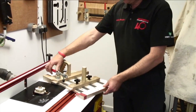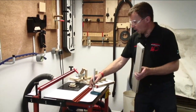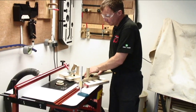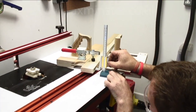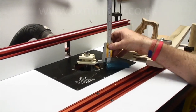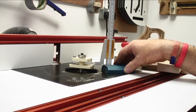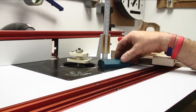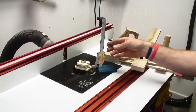We can use the mortise piece we just cut as our cutter height guide, and we'll also use a height gauge. When we cut the tenons, the wood goes face down. So with the rail, we've got our face mark — we're going to put it face down, load it, and lock it off. From there we use our height gauge, bring it down, and lock that. Then we move the cutter height — on the Bosch router we've got quick movement — and set the top of the bottom tip level with that height gauge. Now we've set our height: the internal face of your mortise is leveled on the cutter. Fantastic way of setting up — really quick and easy.